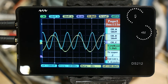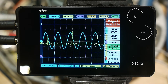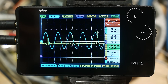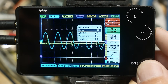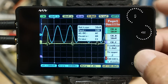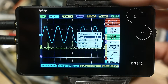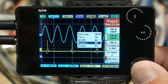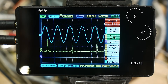I can make one a different shape - let's make one a sync pulse. These little scopes have problems with the sampling rate, and they're not going to give you a clean version of the sync pulse. Let's go to channel one, position - yeah, I can move it up. Go to channel B position and move that down. Probe times one - oh yes, you have a times 10 probe setting, you can change that. It's a bit fiddly running all the menus, but once you get it set up the way you like, it'll stay there.